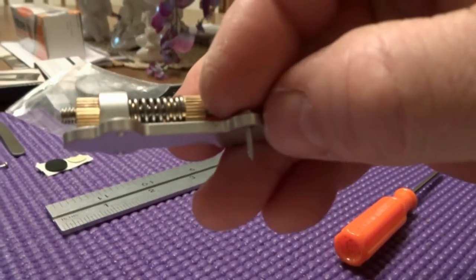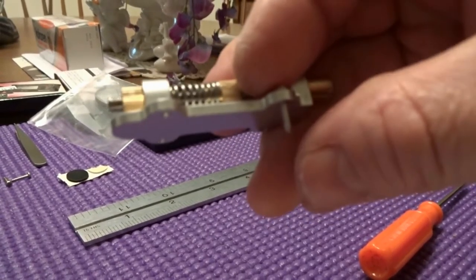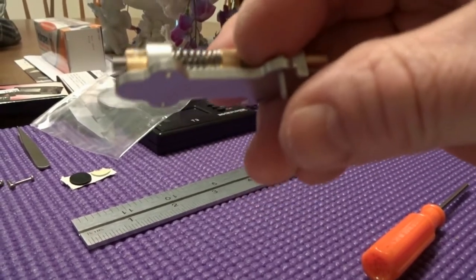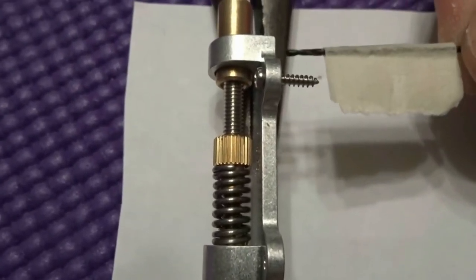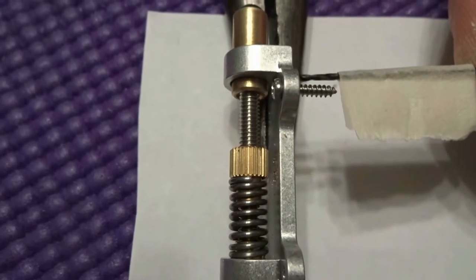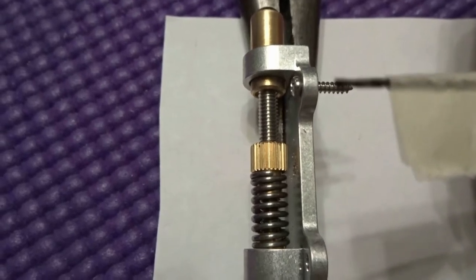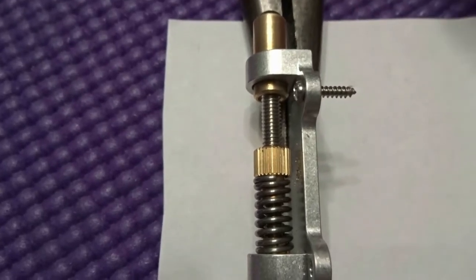Take the screw, put it in place, then butt the drill bit up against the bottom and put a piece of masking tape on the drill bit — just like I did with the string trees. Take a measurement from the bottom of the plate to the tip of the screw and put masking tape at that point. This becomes our depth guide so we don't go too far into the guitar cavity.